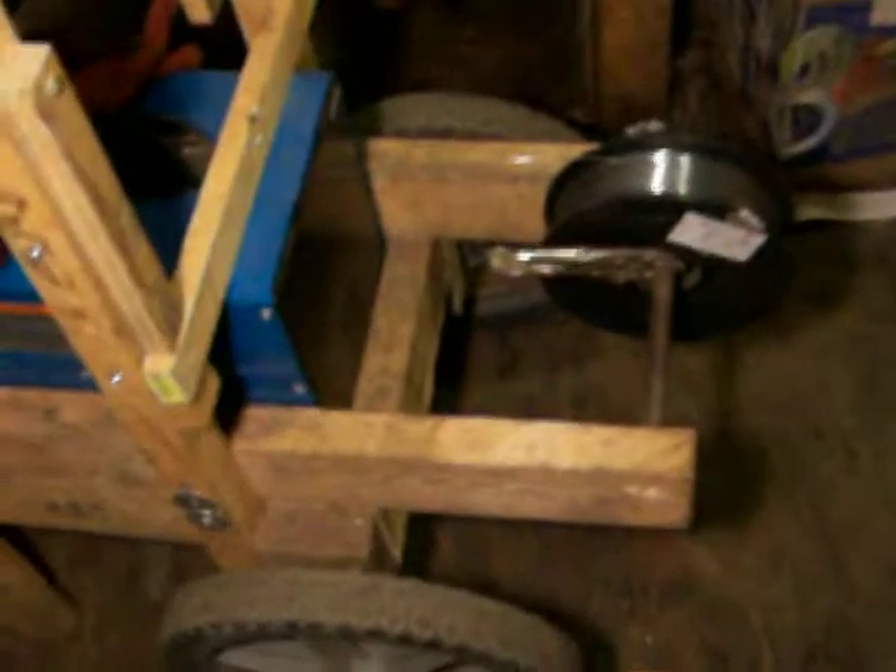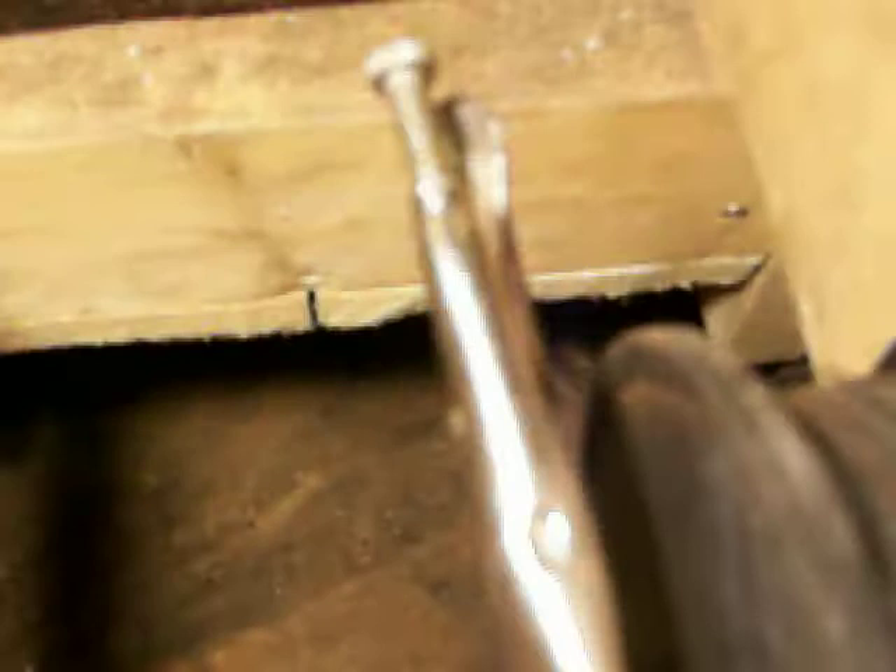To get the 10 pound spool in it like I have, I'd already built this cart and then decided to try this. All I did was drill one quarter inch hole in the back of the welder and built this cart. It's got two 2x4s coming off of it, a piece of 5/8ths round stock going through there, and a pair of cheap vice grips to keep the spool from shifting over.